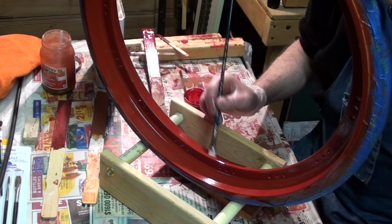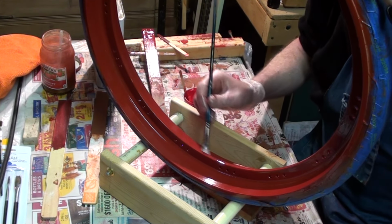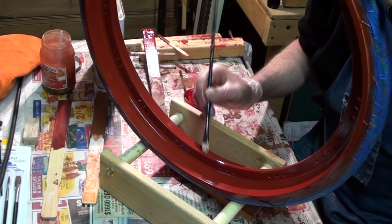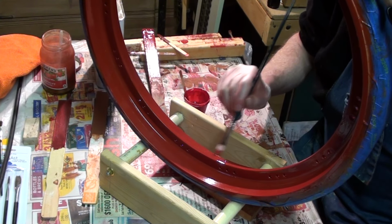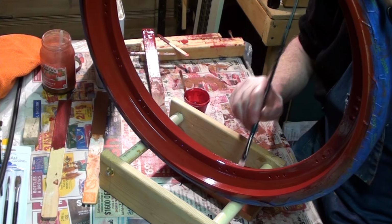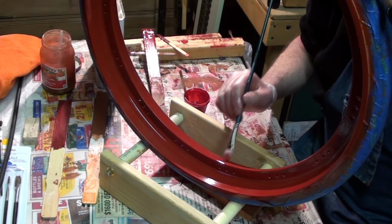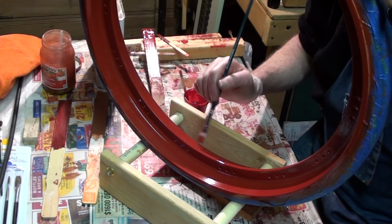After consulting our local paint shop, they suggested a paint line manufactured by Benjamin Moore called Rustcat. It is a urethane modified alkyd resin paint. As of this recording, it was announced this product line is now discontinued, to be replaced by Rust Avoid. So far, I do not know if this replacement product will be as suitable to the project as the Rustcat.